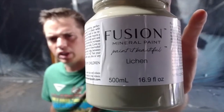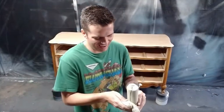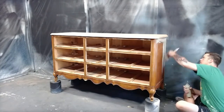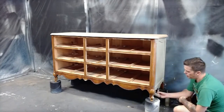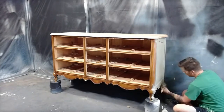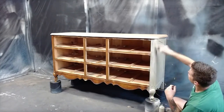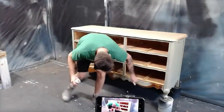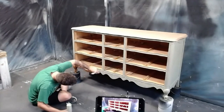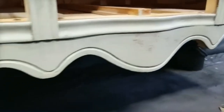To paint this piece, I used Fusion mineral paint in the color lichen. I transfer this paint into a condiment dispenser from the dollar store to keep me from spilling it and wasting any. This was my first time using Fusion mineral paint, so I don't have a lot of expertise on it, but I know I'm going to be asked. I do like the way that it covers and they have a lot of nice color options. I am skeptical about any paint that says it has a built-in top coat, so I did not top coat the paint on this project just to evaluate it for myself. The finish without a top coat is very similar to chalk paint — a matte or eggshell type feel. It wouldn't hurt to add a few layers of top coat if you wanted more sheen or extra protection. I ended up only needing two coats to cover this piece, waiting about 30 minutes in between each coat.